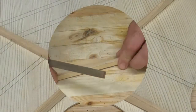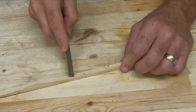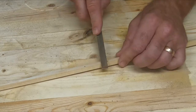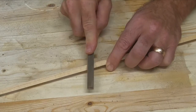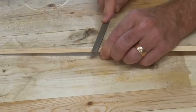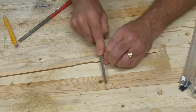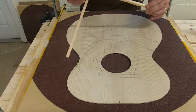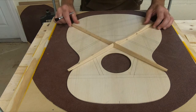Now I'm going to start filing. This might be a little awkward. I made marks to know which direction they're coming into. Most of them are square and it's not a big deal, but the bridge brace does go on an angle. I have all my notches in and ready to glue up. I've got everything set and it's going to sit just like that — I've staged everything, I've got a dryer on, I've got my go-bars all staged.